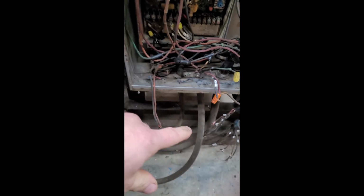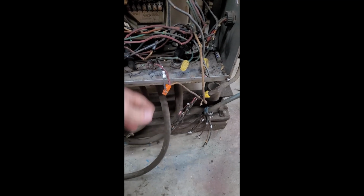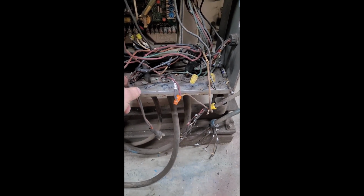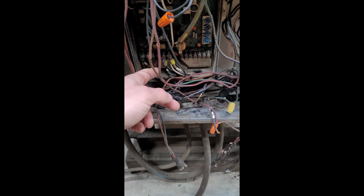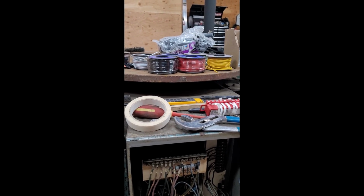and then we'll get the foot pedal out of the way, and then we'll actually take a look to see if the wiring is just as bad throughout the cab tire, or if it's just bad in the exposed sections here. I'm going to assume that it's pretty bad everywhere, but we'll take a look. And then the next one to come out is going to be this power wire. And once you get all this wiring out of it, so this other motor, the turn motor, comes across here and loops up into this lower terminal strip. And then we'll see what I actually need for wires. I've got 6 different colors, a 14 gauge up there: white, brown, black, red, yellow and green. I don't have a blue or anything like that kicking around, I don't think.